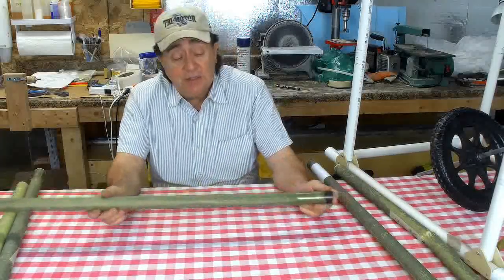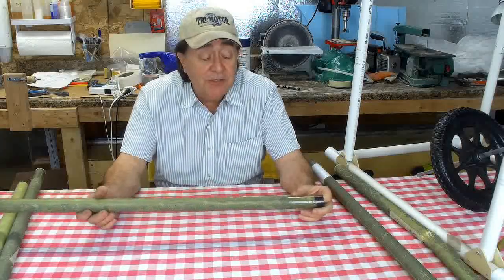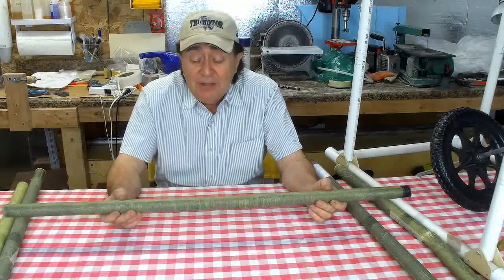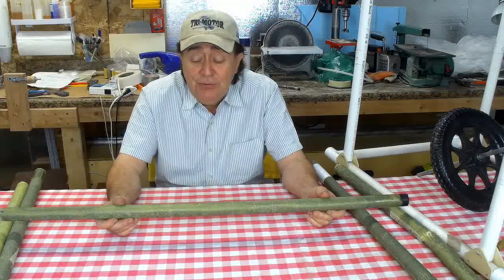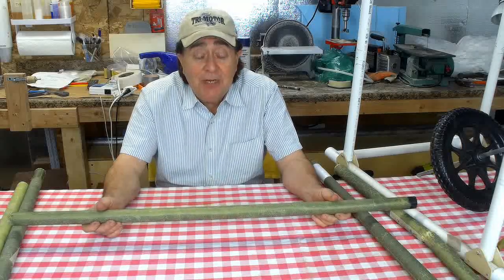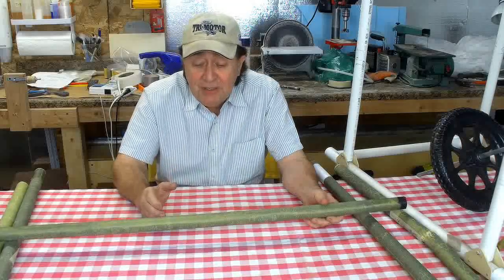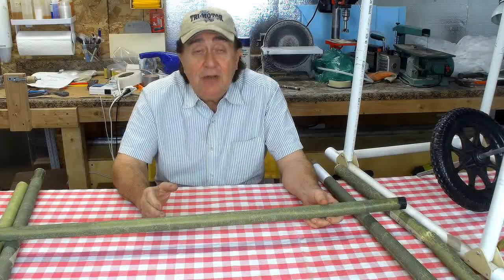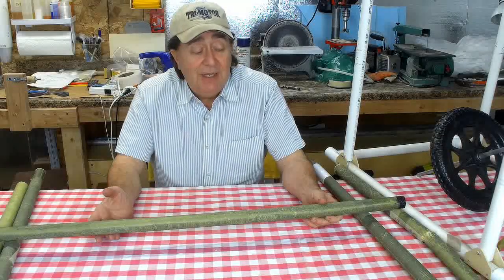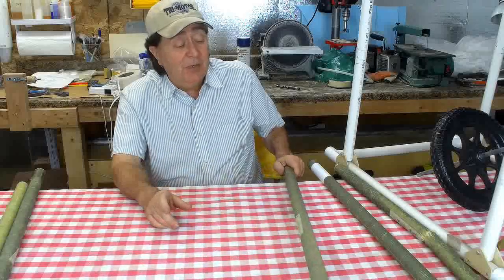So I think this tubing is a little too light because of the local buckling issue. If I can avoid it, I don't want to design to resist local buckling loads, because that just makes the part heavier. And yeah, you're strong enough to resist local buckling, but now you're over strength for the other loads that you're carrying. And it seems kind of a waste to carry all that weight just to prevent the buckling.